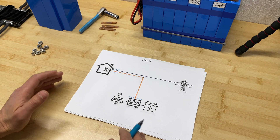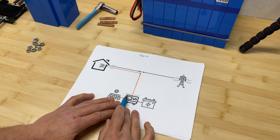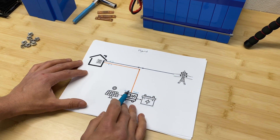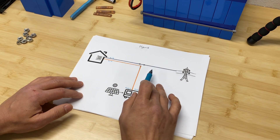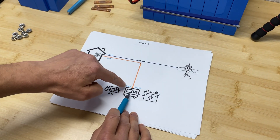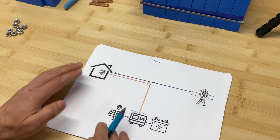The last type is the hybrid solar system — what I have installed. It works similarly to a grid-tie system: the inverter can operate in both grid-tie and off-grid mode and connects to the same panel as grid power. On normal days it pushes power like a grid-tie inverter. If there's excess power, you choose to store it in the battery or push it to the grid. If grid power becomes unavailable, the inverter switches to off-grid mode, the house is disconnected from the grid, and the inverter powers the house on its own.